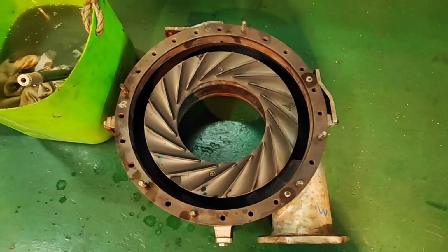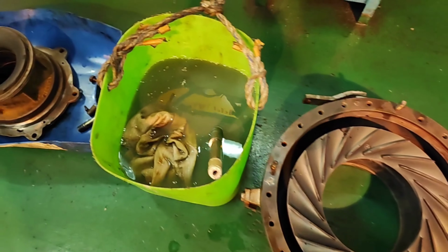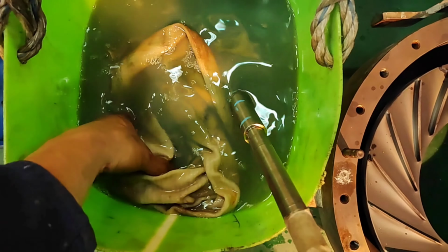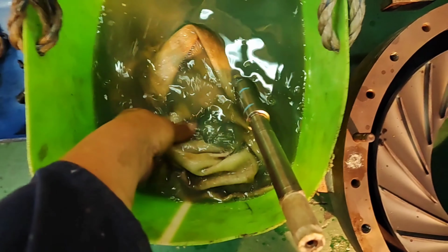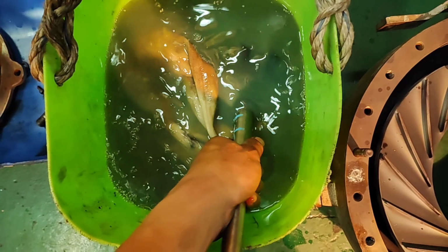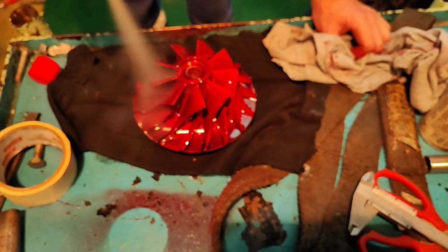The impeller is made of heat-resistant aluminum alloy. Use a soft object such as sponge for washing, with surface dirt removed using kerosene or warm water. Do not use a wire brush or any similar hard object. It may damage the surface of the impeller.